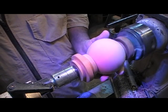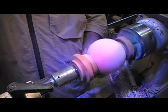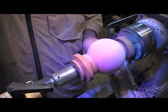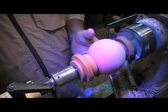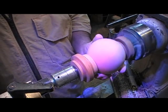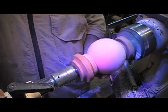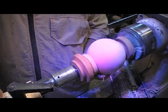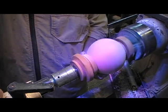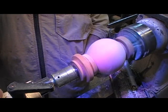Now, see, just put it up and bring the power back to it again. If you sand it too hard and stop it, it'll burn it. But you sand for a moment or so and then you rotate. That would be a burn mark. We'll take it all the way to 400 like this, which is plenty enough for what we plan on doing in phase two.